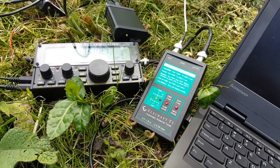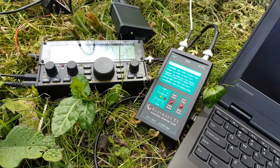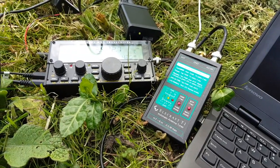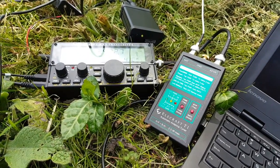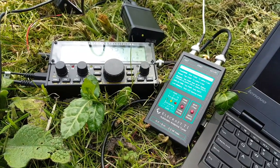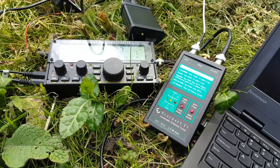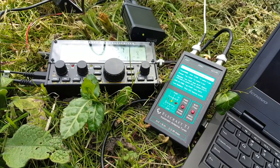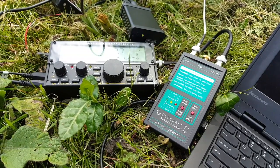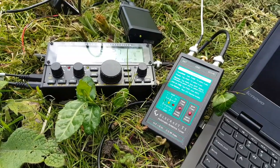The problem is that the SWR is not the same whether I extend the coax cable or not. So I added the Elecraft T1 tuner, which of course is not the way it's supposed to work with the Valley Tuner — now that's two tuners, which means quite a bit of losses probably, but at least it will protect my expensive radio. Now we are back to receiving mode.